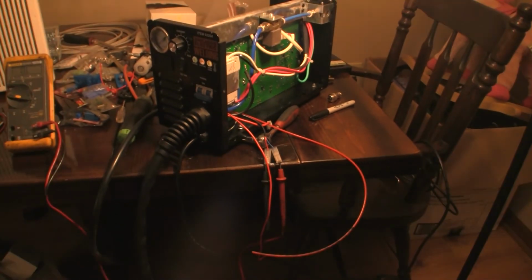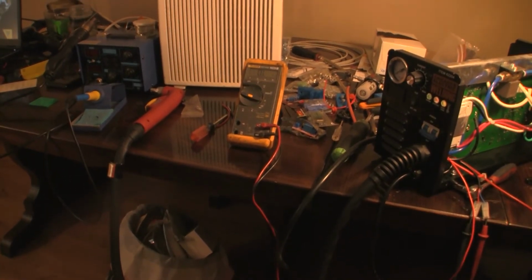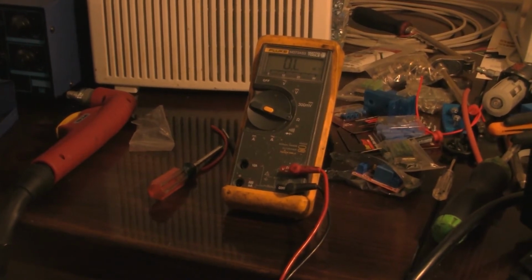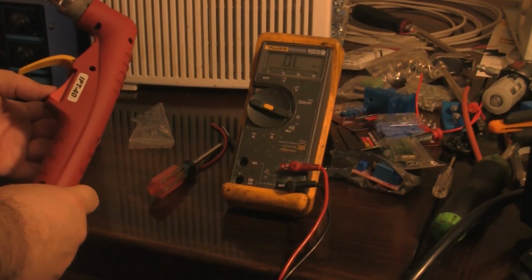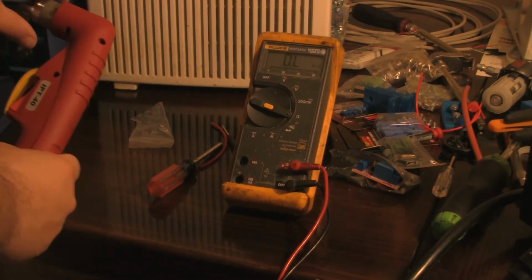So here you can see both the wire and the plastic trimmer line that has been run from the torch to the box. I'm about to show you that I have the meter hooked up in the continuity mode, and I'm checking that the switch still works as expected in normal operation, and then I take the cap off and show that the closed switch performs as expected because the circuit is not complete with the missing cap.